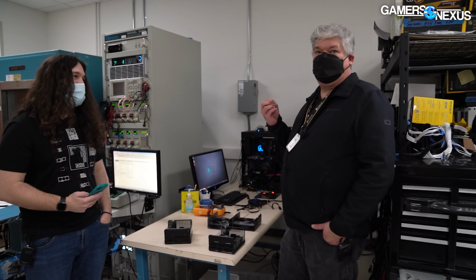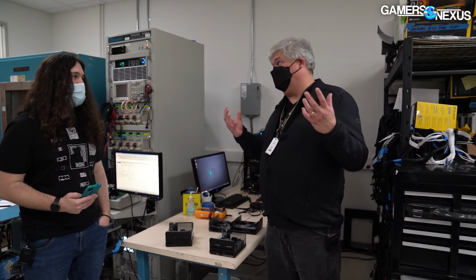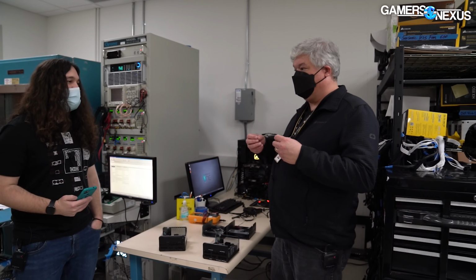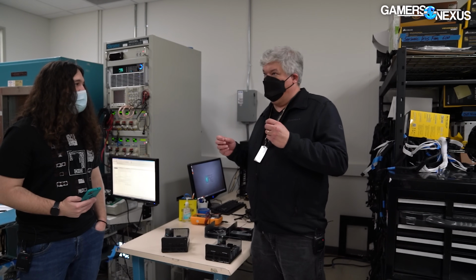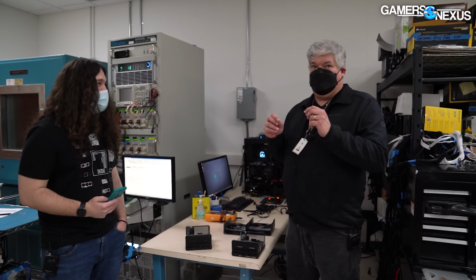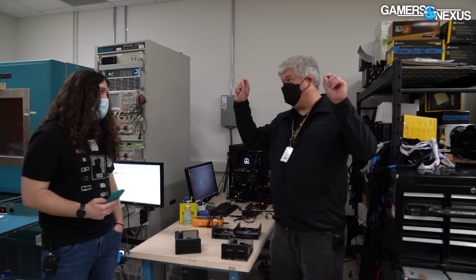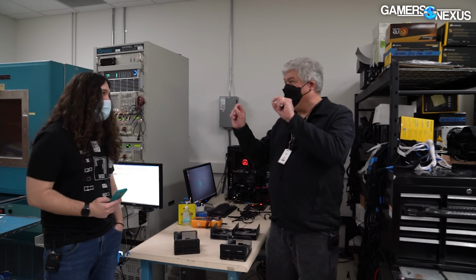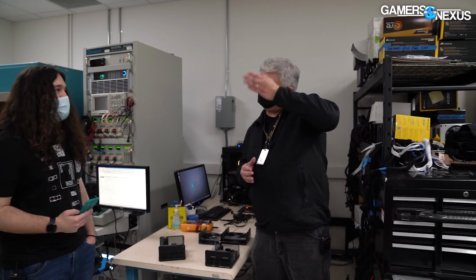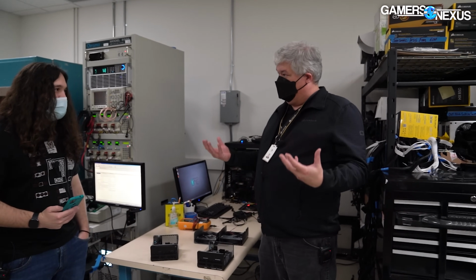Okay. So 20 years ago, one person came out with this idea, and everybody saw it as a revelation, right? But then everybody kind of did their own riff on that because of different costs. So, like, one of the original fully modular power supplies, or even semi-modular for that matter, had 1-to-1 pins. Well, that's a pain in the neck on the PCB because you have 3.3 volt here, 3.3 volt here, 5 volt here, 5 volt here, 12 volt here, 12 volt, right? So somebody else came along and said, okay, let's put all the 12 volt here, all the 5 volt here, all the 3.3 volt here, to make it easier to lay out the PCB.